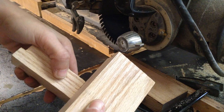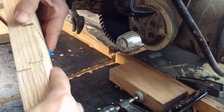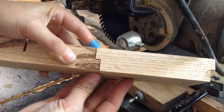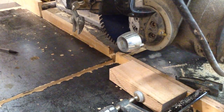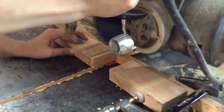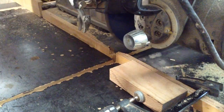You can see I set a stop to get the right width, which is going to be the width of all my boards. Then I raised the radial arm saw and did a couple test pieces to cut exactly halfway through the piece so that my lap joints will be nice and flush. There's always a lot of testing and changing the depths to get it perfectly accurate before I go and cut all my pieces, so it's always nice to have some pieces left over. Whenever I use the radial arm saw for this, I always emphasize there are easier ways to do it, but it's really easy to set up these laps here and the repeatability is also quite nice.